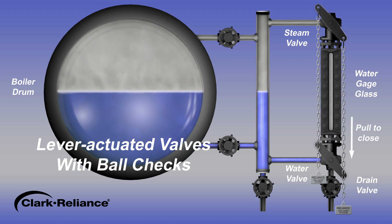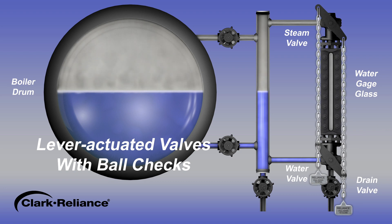First, check the upper and lower water gauge valve and drain valve to be sure they are all in their closed positions. Confirm the operating chains and pull handles have been installed on valves per the OEM instructions, with the levers aimed downward at about a five o'clock position and the chain installed taut on the right pull-to-close side of the levers. A little slack on the left side is acceptable. If one valve opens slightly more than the other it is okay, but they must both close tightly with no slack on the right pull-to-close side. Be sure both handles are installed on the bottom ends of the chains.